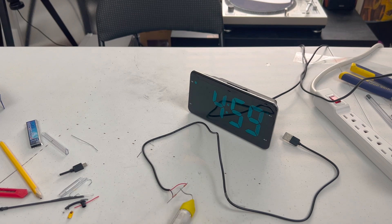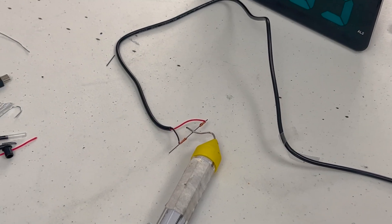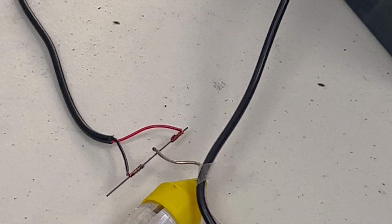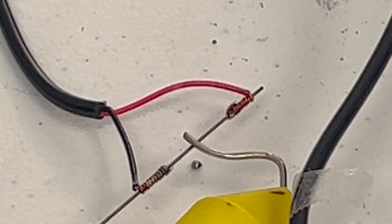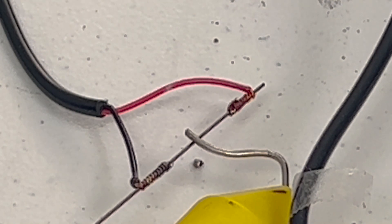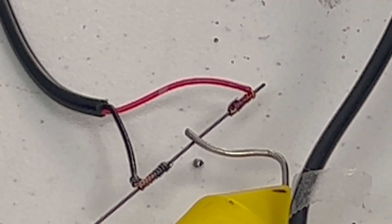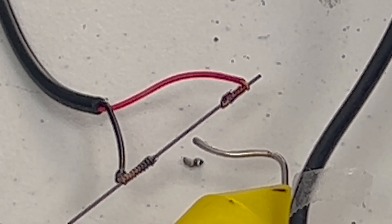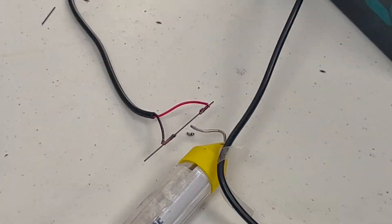The pencil lead is a huge difference — that actually got hot and fast. I have no idea why the wire didn't get that hot, but I can smell it burning in here. That thing is hot, hot. Just as another test, I'm actually going to put that piece of solder across the pencil lead now and plug it back in to see if we melt any solder. Plugged back in — you can see we did short out again, we are getting smoke again. Despite all the smoke, it actually got hot enough — it melted a ball of solder! Oh my gosh, you can see we're charring those copper leads and we're actually ballooning up the heat shrink casing surrounding the wire. And we melted more solder. So even though it's a super slow conductor, graphite does get hot enough to melt solder. Holy moly — and our alarm clock still works. That is unexpected.